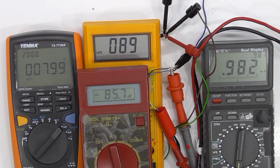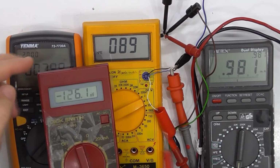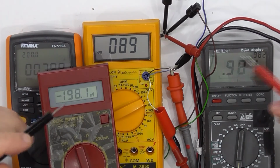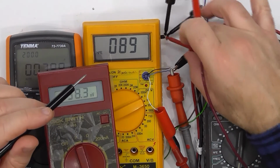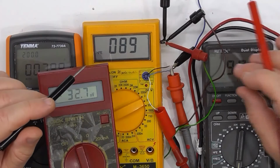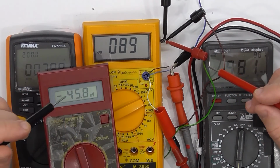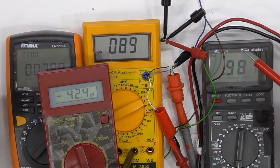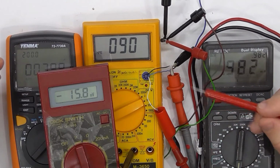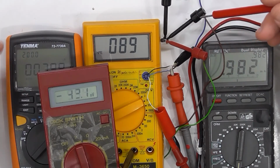And it's got, I think, a 1 megohm input resistance, but anyway, it should be sufficient. So let's just drop the weight behind here. If I measure the base emitter, right? If we go to the common, that'll be on one side of whatever the emitter resistance is.